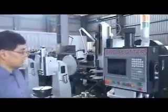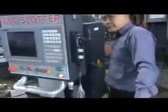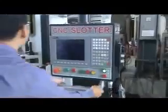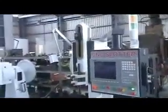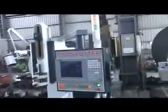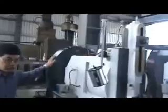When you receive the machine first, you turn on the power. The first step, you turn on the power, then turn on the controller to run the machine, to test the machine first. Then you must connect the power through the transformer to the machine.